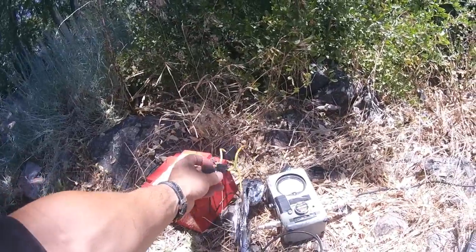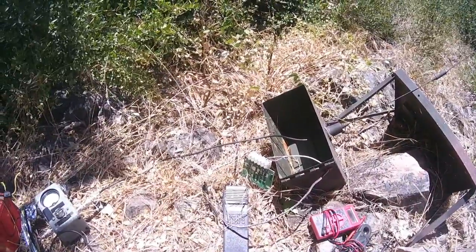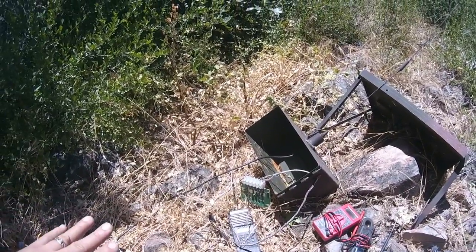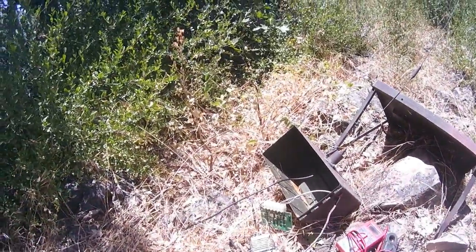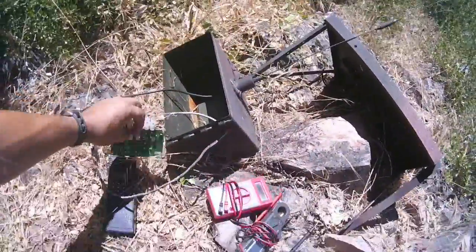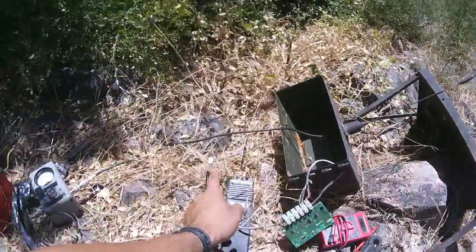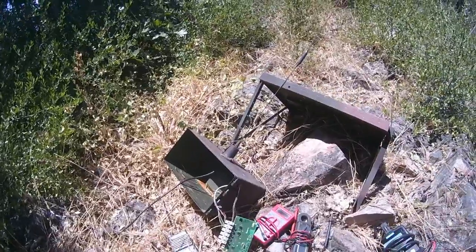The battery's fuse saved it by doing its job — it blew and took the whole system down. That would explain the static from my garage and really poor range. That must have been from the toss down from the rocks, the antenna being upside down, and eventually that compartment getting flooded where the control board was. The water corroded the components, damaged the board, shorted out the components, blew the fuse, and took the whole system down completely. So all of that made sense.